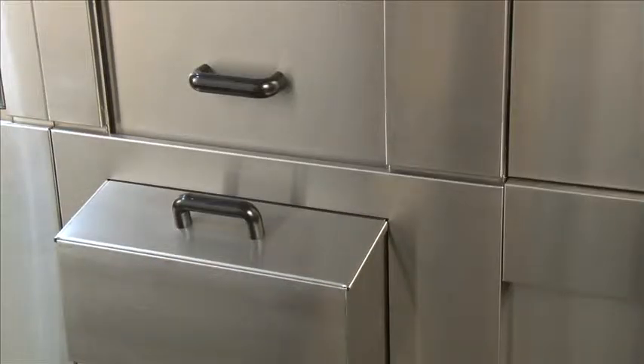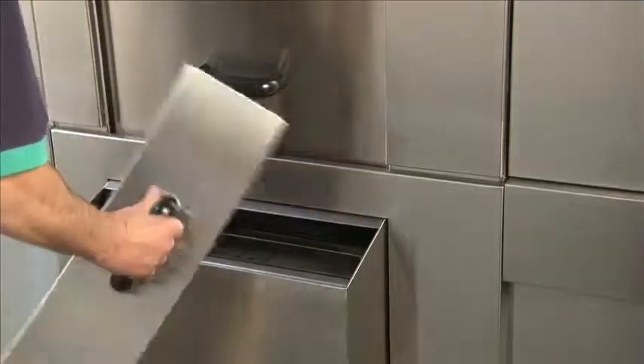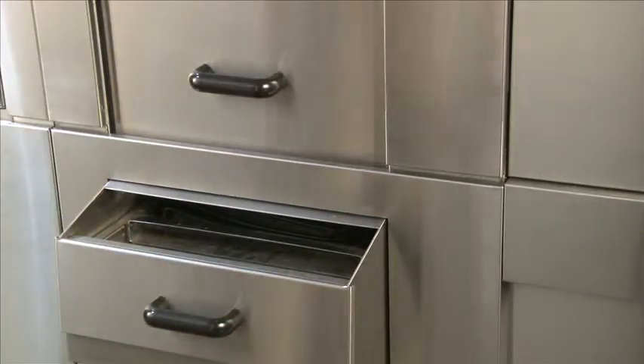This is a standard feature of all Champion flight machines — the external pre-wash bucket on the pre-wash section. It is designed to be easily accessible without having to open the doors to clean inside the machine. To access it, simply lift the lid off and hook it on the front, so you can use both hands to get to the bucket and the scrap screen.